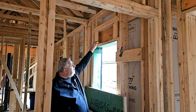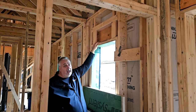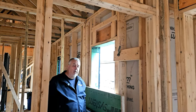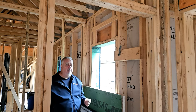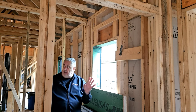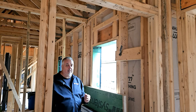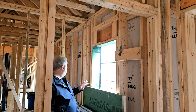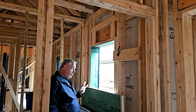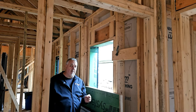The idea of the pocket header is that we have an insulation cavity. We just don't build that out with solid wood and give up the opportunity to insulate that. It's a small piece, but if I take that cumulatively on, say, 30 windows in this house, it probably becomes a space close to this area of this particular wall right here. So it's not insignificant.